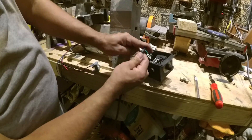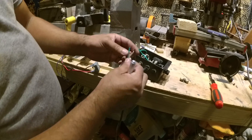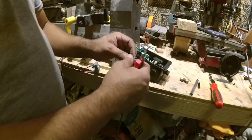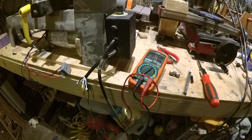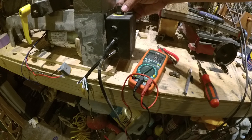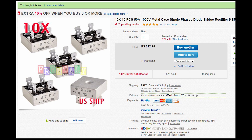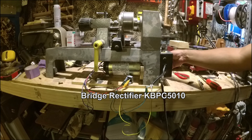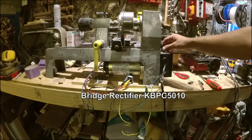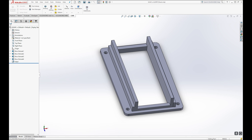This is what I was talking about — I was trying to use the original driver for this, and it worked, but it just didn't work very well. It spun too fast to start. If you've ever used a wood lathe before, putting an oddly weighted piece of wood on it is really dangerous. That's the bridge rectifier there on the left side of the screen. I'm routing through the bridge rectifier to be able to control the speed, turning AC into DC, because I think that motor's DC.